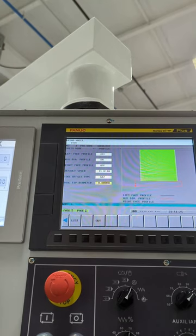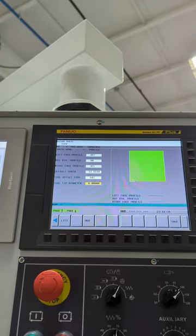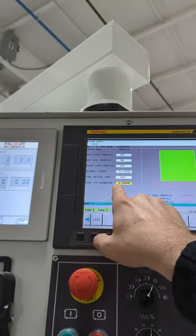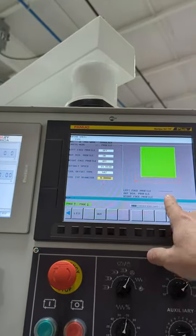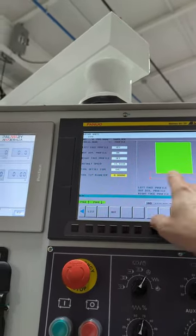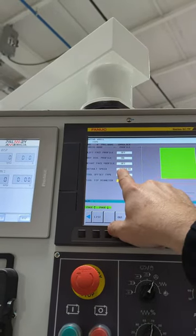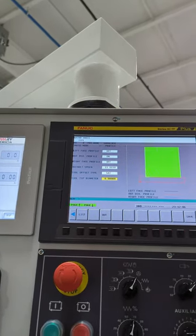As for tool offset, I'm not really using that, so you could either turn that off or set it to zero on the tool tip. But I left it on in case I started seeing wear and wasn't getting the geometry I wanted, then I could offset some tool tip wear. My diamond wears, and when it wears, it decreases the accuracy of your actual geometry, and your speed too. You'll have to change it. As you get more of a flat diamond, you'll want to go faster across there, because otherwise you'll be dulling your grits again instead of keeping them sharp.